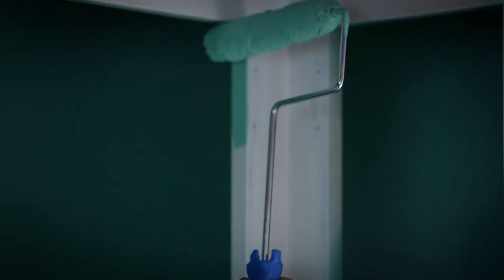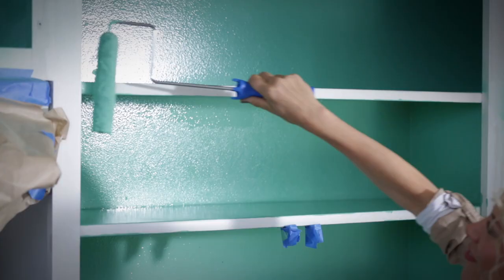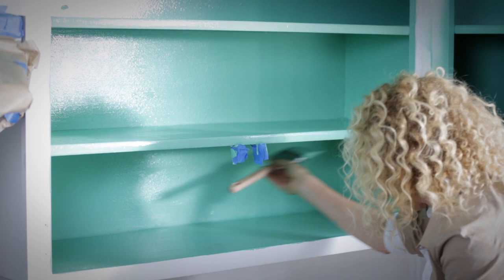This is going to look so gorgeous. Be sure to paint the door edges, cabinet edges, and drawer edges, along with the back side. Let the paint dry completely on all the doors, drawers, and cabinet frames. The first coat of paint should be given at least four hours to dry before applying another coat. You probably do need a second coat, because the second coat can be the difference between a job looking pretty good and a job looking extremely professional.